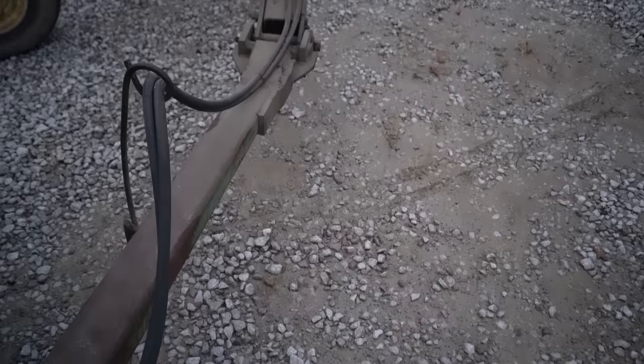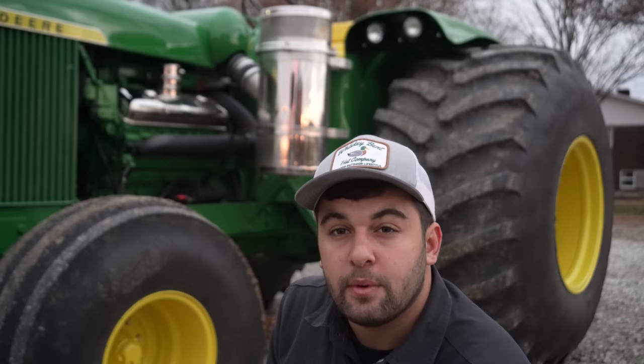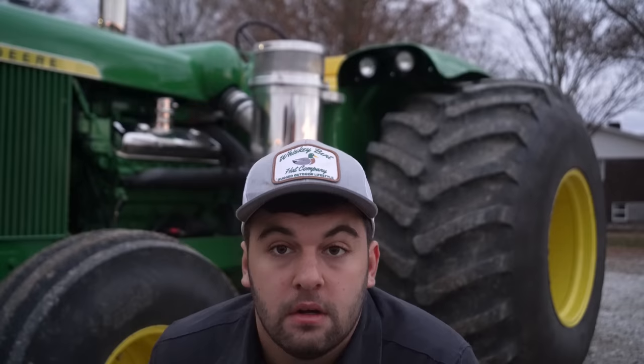It's got a synchro range transmission. We pull a six-bottom John Deere 3600 plow, and it'll pull it in fifth or sixth gear depending on conditions. In sixth gear you can run a little bit lower RPM, which is helpful to your ears, and it does really well — you can run sixth gear at about 1800 RPM. Or you can run fifth gear wide open, and that's also really fun. It handles the six-bottom plow really well; it could pull a seven-bottom, but the six-bottom we can move around to a couple different tractors, so instead of getting all of our plows dirty, we just get the six-bottom out and have a little fun.